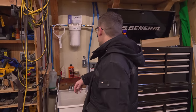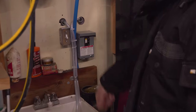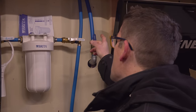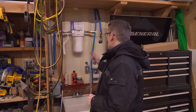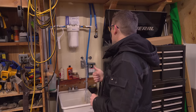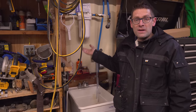Here we are in the main shop area. You can walk right in the door over to the utility sink. We've got a breaker-style main power switch for the compressor and an air ball valve. We're using Maxline three-quarter inch throughout the entire shop. What's great about Maxline is it's really easy to work with — you cut it to length with the included lopper tool, there's a chamfer tool, the fittings use compression and O-rings, it's mesh-reinforced, and it doesn't cost a lot. You can switch on the compressor, the air, and then the air dryer right here.